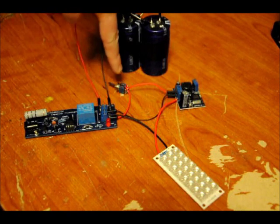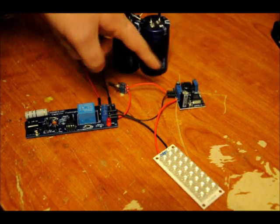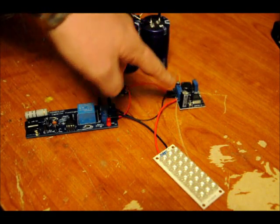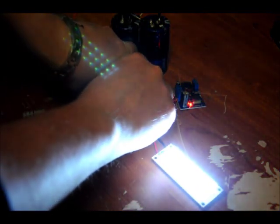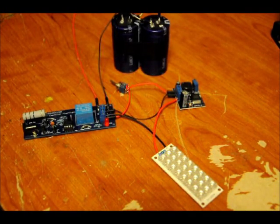What I've got here is a switch that will take that power stored on these capacitors, put it through a voltage booster which I've tuned to 10 volts, which then powers this extremely bright LED bank. It's very bright, and it's only tuned to 10 volts. I can tune the output to 12 volts and make it even brighter, but if you have it tuned to 10 volts, this lasts a heck of a lot longer.